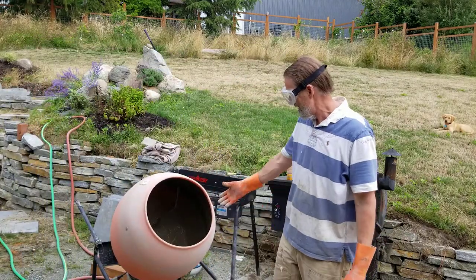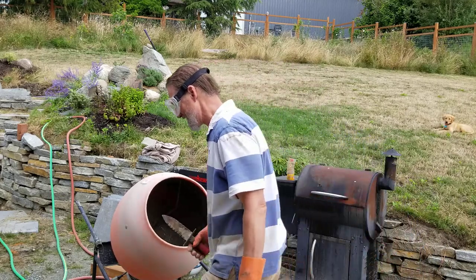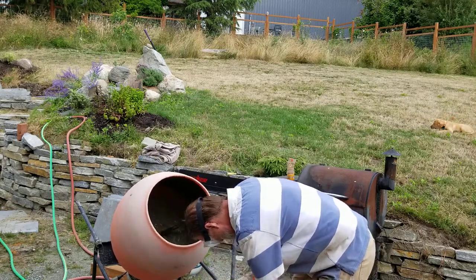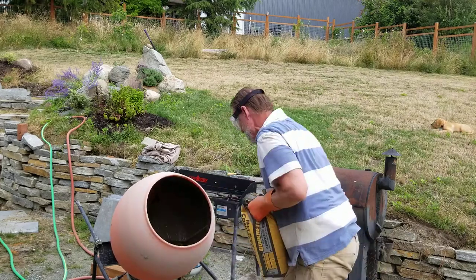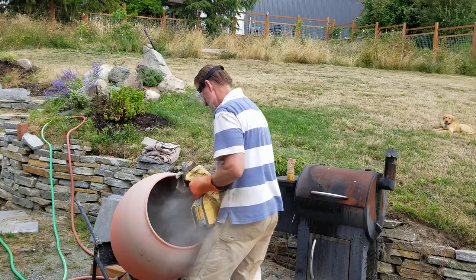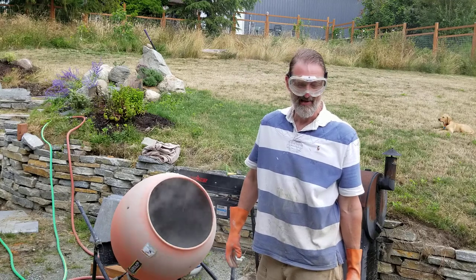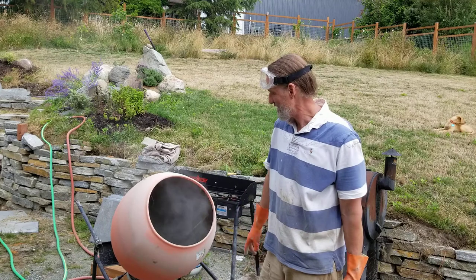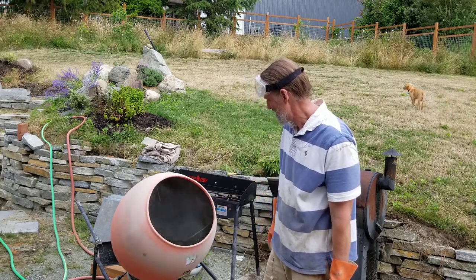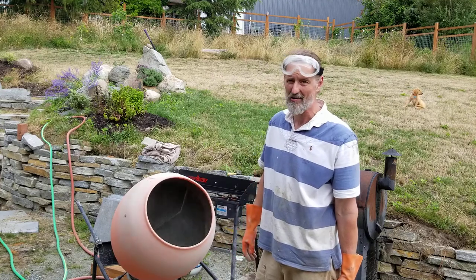Okay, goggles on. We've got nine and a half cups of water in the mixer. Take a blade and cut your bag of concrete open. Don't dump it all in at once — go in half a bag at a time and give it a few seconds. The thing you don't want is dry concrete stuck on the back of your mixer; that's a nightmare. With nine and a half cups already in there, it's pretty soft and I don't have a bunch of dry material on the back wall — getting that out while the mixer is turning is dangerous.